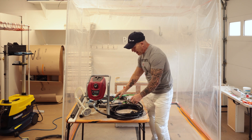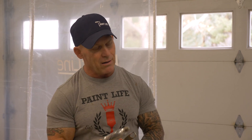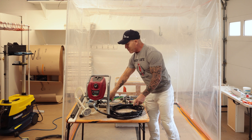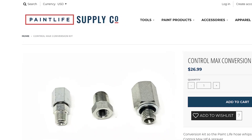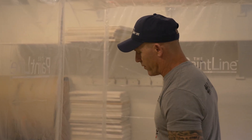Can you actually attach a whip to one of these hoses? They have a proprietary end — Titan has made an end on here that is not the same as any other airless hose, so you can't take another airless hose and run it on this gun. These ends are completely different from every other quarter-inch airless sprayer out there. But we at Paint Life Supply Co. have made it so you can run a whip that makes your gun more flexible and easy to manipulate. We've got three fittings that make that work — in our store it's called the Control Max Conversion Kit.